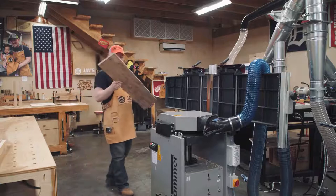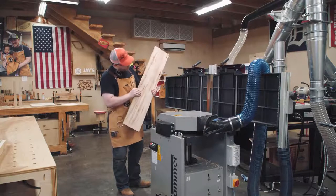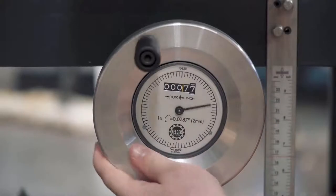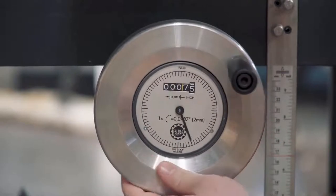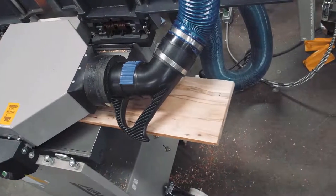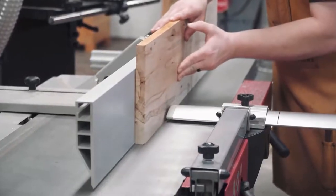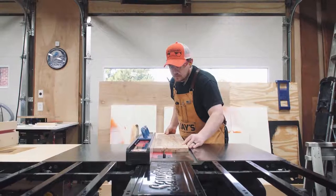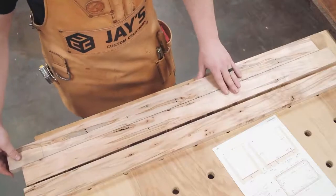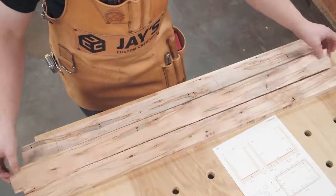Next up are the rails. The only piece I had left was already planed to seven-eighths of an inch thickness and unfortunately had a little bit of bow. Rather than chasing the bow out at the jointer, I decided to just skip-plane it down to the final three-quarters of an inch thickness — I would rather have a full three-quarter inch thickness with a very slight, probably unnoticeable bow than joint and plane the bow out and be left with thinner material. The board was then jointed on one long edge, the rails were ripped to a smidgen more than the final width at the table saw, and working with figured wood like this it's pretty exciting to shift pieces around to get the look you're after. I was able to lay out really interesting grain on all four rails.